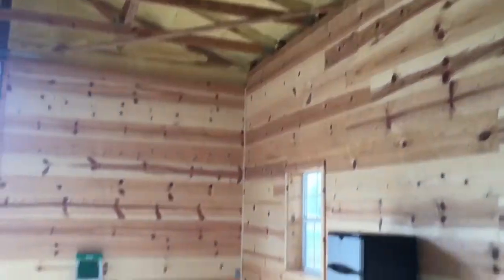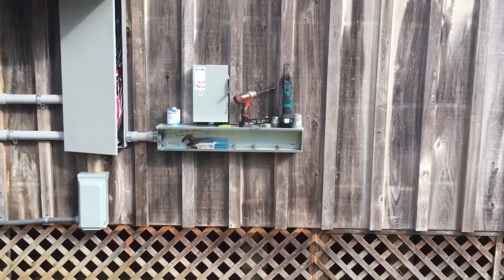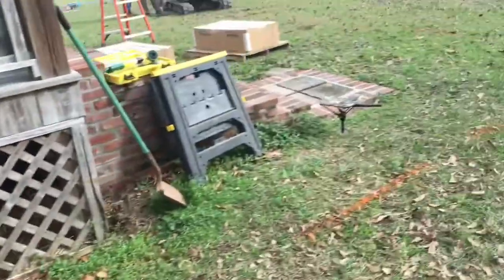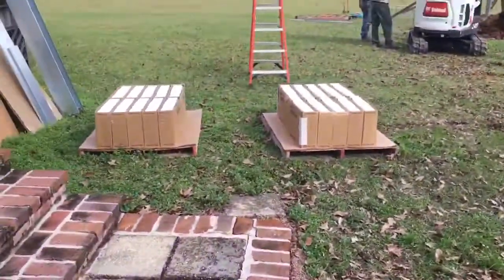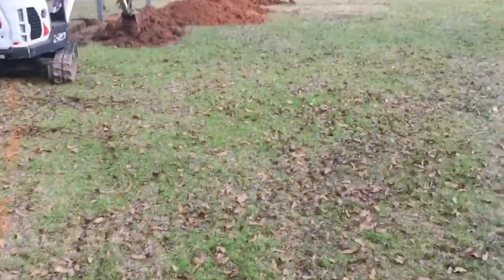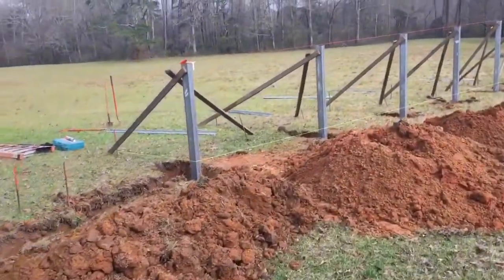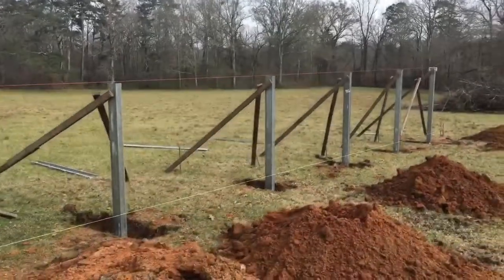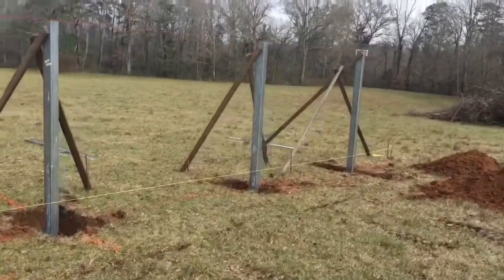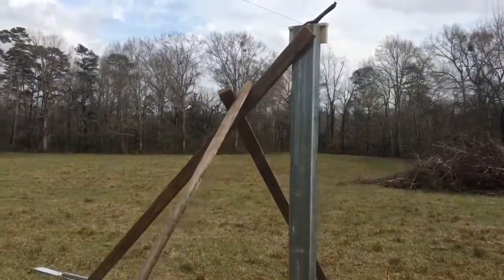We're halfway through the day, just got done with lunch. Got a gutter up connected to the main panel, they've shored up underneath for where the batteries are going. The battery rack is inside the house, the batteries are right here, all the electrical equipment's on the porch. Scott, Abraham, and Antonio have started the trench and we have the posts all set up and ready for concrete. We're a bit bummed we can't pour concrete right now, but we've got concrete coming in the morning. There's about three feet of fall on this array so it's going to have a pretty tall post at the end.